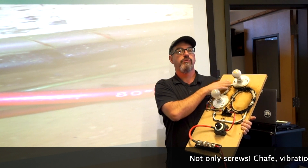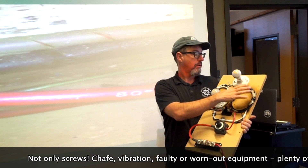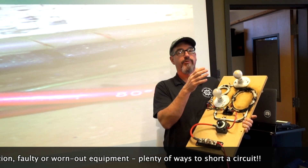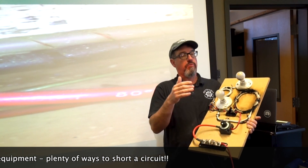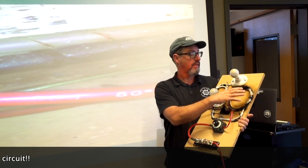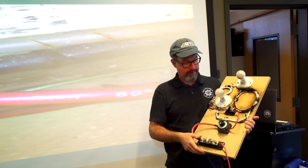When you short circuit a wire — very low resistance — you get maximum amperage. That couple hundred amps just melted this. We had 12 and 14 gauge wire here, rated for about 35–45 amps, so we were doing 3x to 4x of what's allowed. Of course the insulation gets hot, it melts, it burns, it catches the wood bulkhead on fire. It's just a bad day at sea.